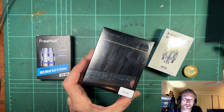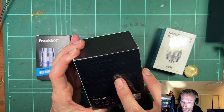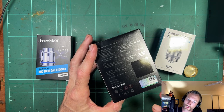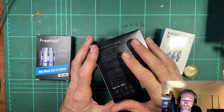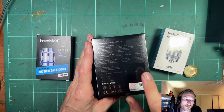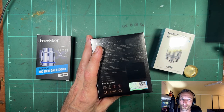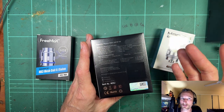I haven't seen this mod at all before, so I've got no idea what it even looks like. We better just have a look at the specs real quick. It's all pretty normal stuff, apart from what I think is interesting: it's a 168 watt kit. Everything's normally 200 watts, 220 watts, that kind of range when you get the dual 18650s. I thought it was kind of peculiar that it's this really specific number, and I thought, well, maybe what they've done is limit the maximum wattage of the mod based on a realistic current draw number for cells that most people are likely to be using.